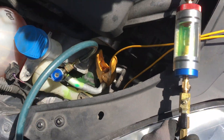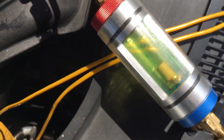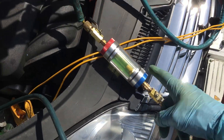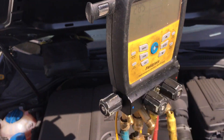As I hooked up, I got some gas and refrigerant in here prior to letting you guys see it, so it's already contaminated — it's not a clean, clear system. But what I will let you see: I have it on vacuum right now. I'm pulling the vacuum on it and I got it down to 290 microns.